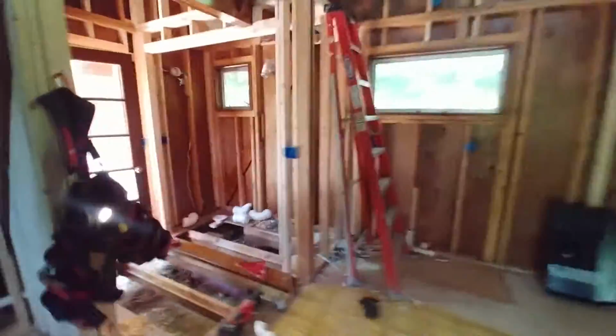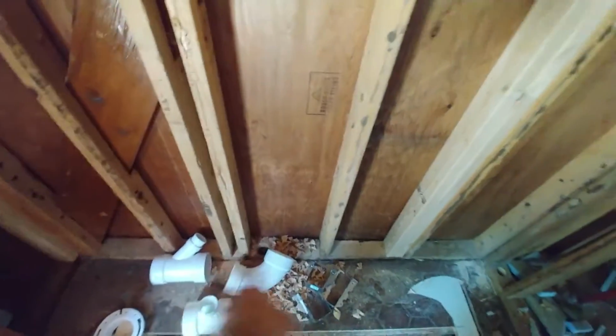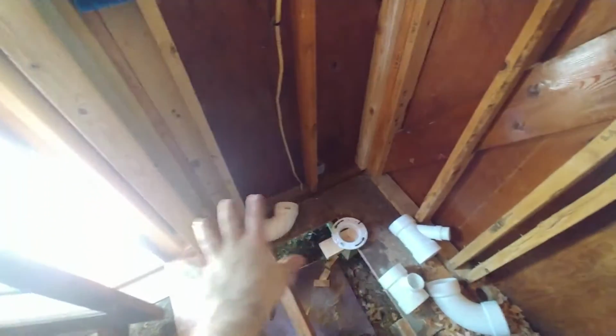I believe we're going to move the sink over, which would put that right in the wall with the existing vent, so we could catch that vent. He'll be going right by, and we just jump over and vent the P-trap, and then keep right on going and catch the kitchen sink. But then there would be nothing over here other than the toilet. Everything, washing machine to our left, shower, sink on our right, would all start here and run in that direction to drain, which is nice.